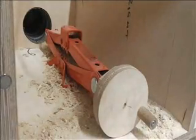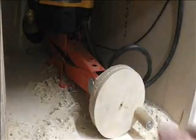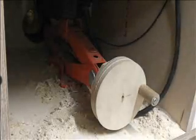I don't know if you'll be able to see once I've dropped the router down — it's a bit too dark in there. But you can see if I start turning that, it does lift the router very nicely. I've also fitted these little hold-downs here, because I was aware that we could have a problem with the jack just pushing the table up and down rather than the router up and down. So what I've done is put these here just to lock the table down so that the jack can work more efficiently.